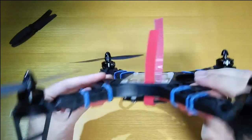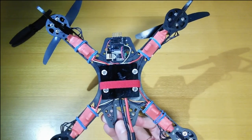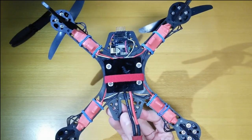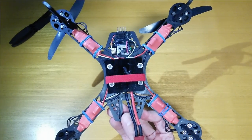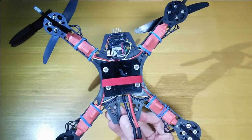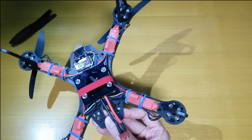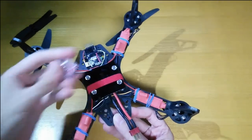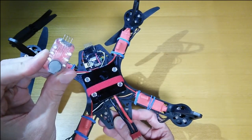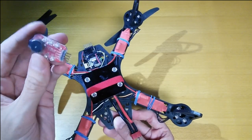The other things you need to fly this — I included the battery in that $123 total. You also need a battery charger; I got one for about $22, though I'd probably spend about $30 next time for a nicer one. You'll also need a little battery alarm like this one — about $3 — which you plug into the balancing plug of your LiPo battery. It makes a loud beep when a cell drops to 3.5 volts, so you know to stop flying and avoid damaging the batteries.